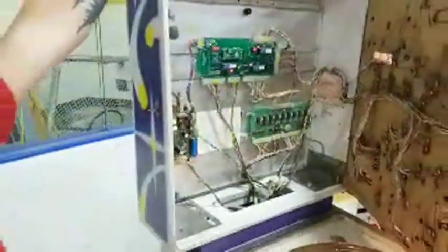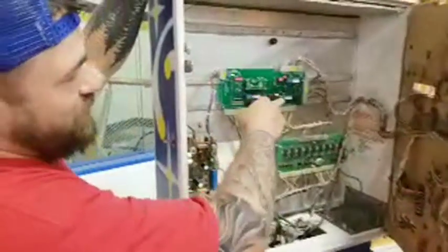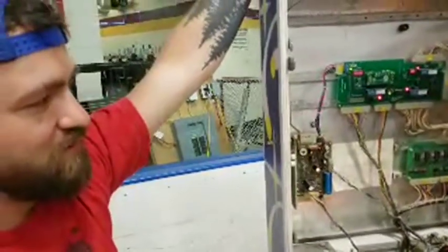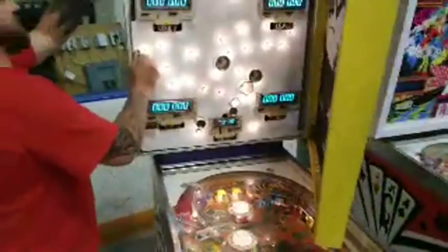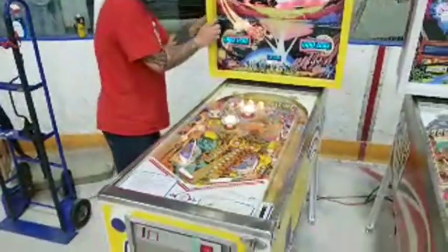How did the original machine generate sound? It would have come off the main board up here, but that's gone now. The sounds would have been stored in a ROM — essentially burned in — and that original card would have been around the same size as this one. Would you be able to close it up and give us a quick demo of the Raspberry Pi actually controlling a real pinball machine?